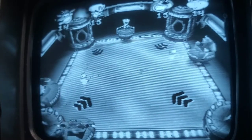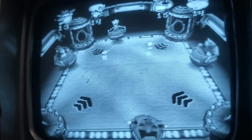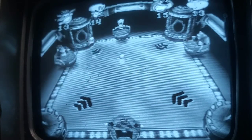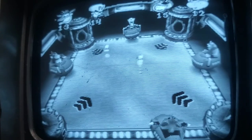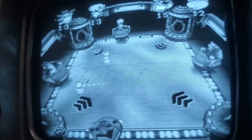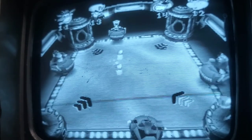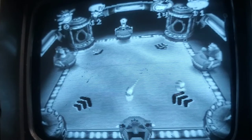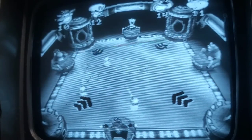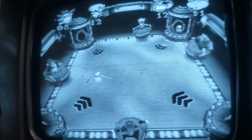It's not bad though. You may be wondering why we used the guts from a different TV when we had a perfectly good TV. Well, you may have noticed that TV only took RF input. You can't hook a PlayStation to that without a stupid little adapter. So we had to put in a board compatible with composite video. Of course, the new board is not compatible with RF input, which is perfectly fine because there aren't any usable signals on the airwaves anymore.